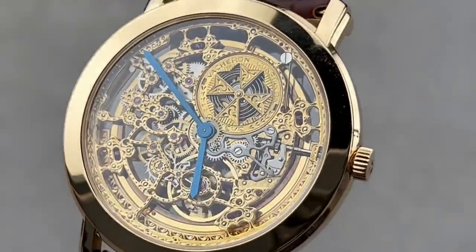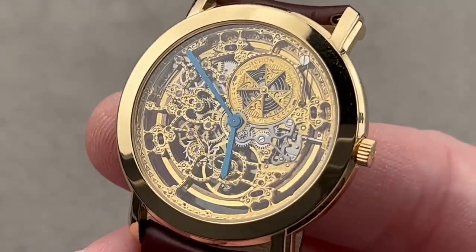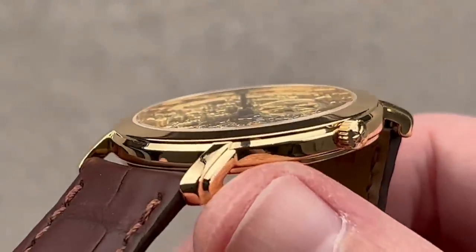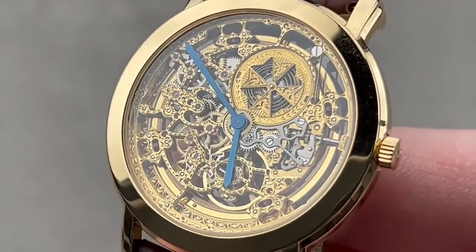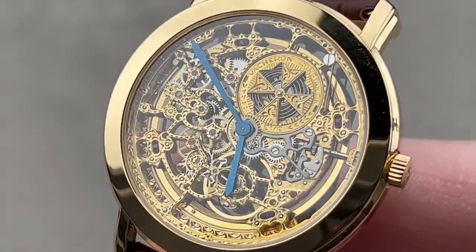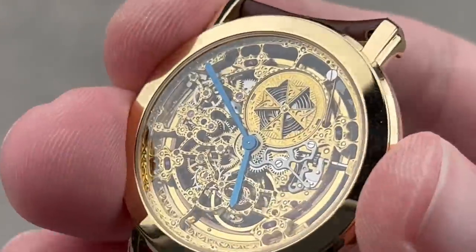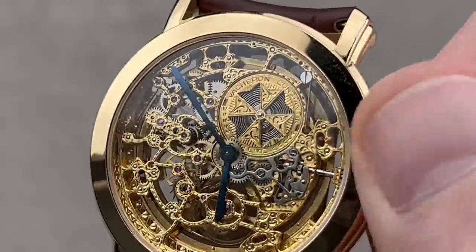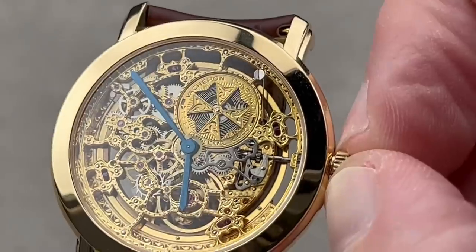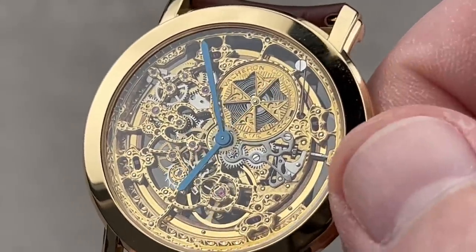In the early 2000s, Vacheron launched the Malte collection — at the time not a collection of tonneau cases as it would later become, but a collection defined by lovely flared and stepped lugs. This is the Malte Skeleton, 35.5 millimeters in diameter in yellow gold, under six millimeters thick. It has beautiful welded-on lugs in a handcrafted case, framing caliber 1120 — also based on a historic JLC ébauche, originally designed in 1967 for Vacheron, Patek, and Audemars Piguet. The movement has never been used by any other company, including JLC. Here you can see the action of the keyless works winding the mainspring inside a fully skeletonized barrel with the Vacheron Maltese cross logo, and the mainspring coiling as a sort of informal power reserve indicator. Pulling the crown out engages the setting pinion, allowing me to set the motion works.